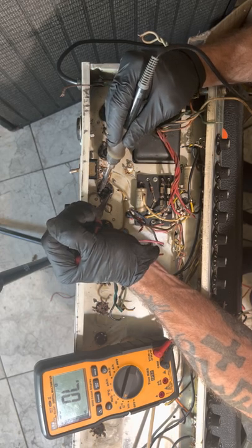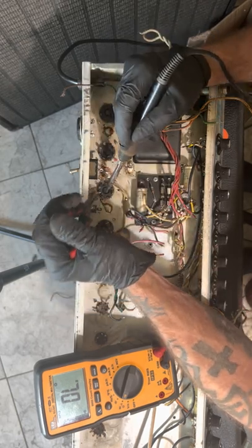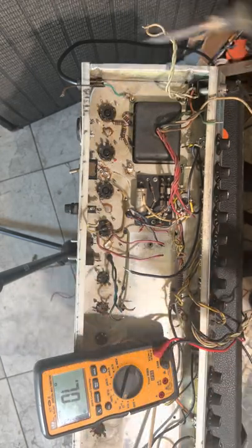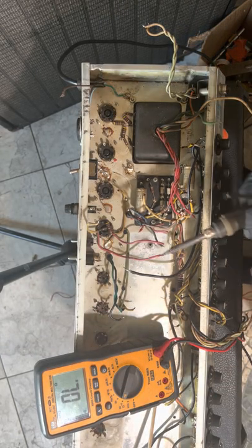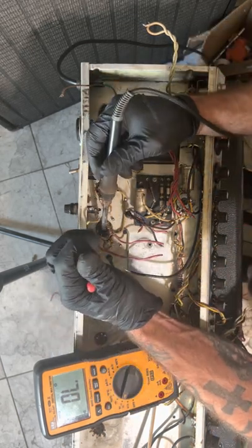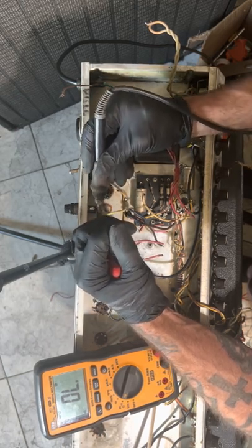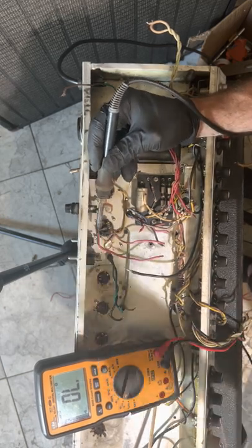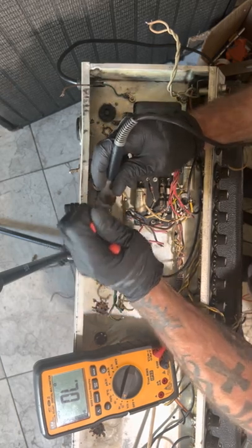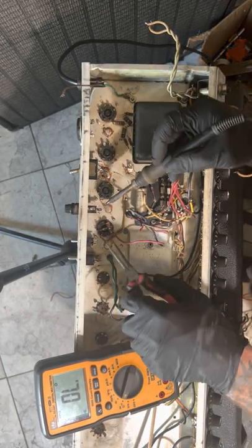And I'll tell you, anytime I have a power resistor, like if it's a plate resistor, maybe not a plate resistor, but a B plus dropping resistor, I'll use a metal film. We'll not use any carbon on them. It's the way I've always done it. Now plates, I'll use carbon film. I like carbon film. Carbon comp, not so much. They look cool. I think carbon comps are the coolest looking resistors in the world. They sound like, they're so noisy.